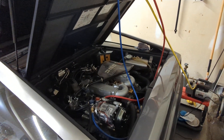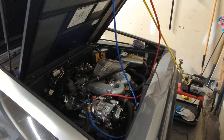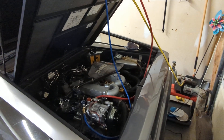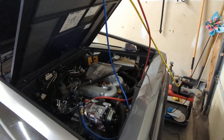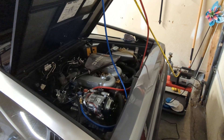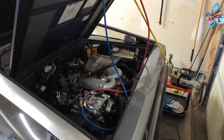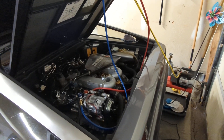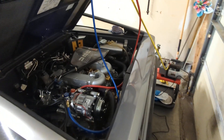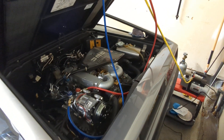If you didn't have any leaks, you could now charge the air conditioning. I'm not going to be able to do it right now because it's winter and I need the garage door open with the car running for exhaust ventilation. So what I'm probably going to do is charge it with nitrogen just so there's no moisture in the system, and then let it sit until spring, evacuate it again, and charge it up for real. Thanks for watching - if you have any questions, you can always reach me directly.